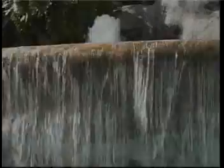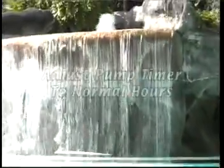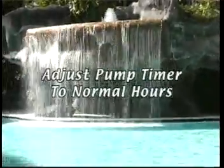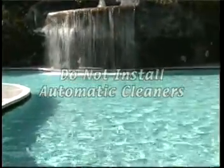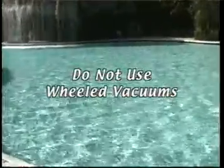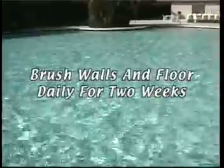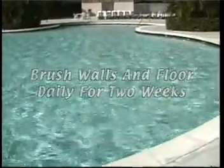Maintenance. Lower calcium levels help to reduce scale and discoloration. Adjust the pump timer to normal operating hours. Do not install automatic pool cleaners for 28 days. Do not vacuum the pool with a wheeled vacuum for 14 days to avoid leaving wheel marks. Brush-type vacuums may be used immediately. Brush pool walls and floor daily for the first 2 weeks.